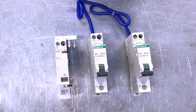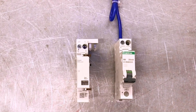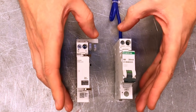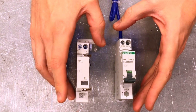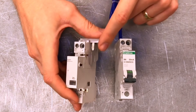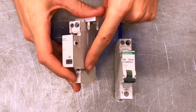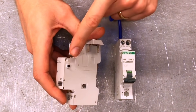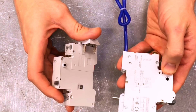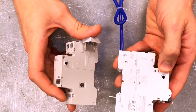On camera, we're going to connect the 6 amp type B miniature RCBO to the arc fault detection device. To be honest, this is actually the second attempt — the first time on camera I nearly took my finger off with a screwdriver, so we've found a safer way. When connecting the AFDD onto the RCBO, the clips hold the two devices together — make sure they're out of the way first. There's also a keyway from the AFDD that marries up with a slot on the RCBO, which allows the AFDD to trip the RCBO.